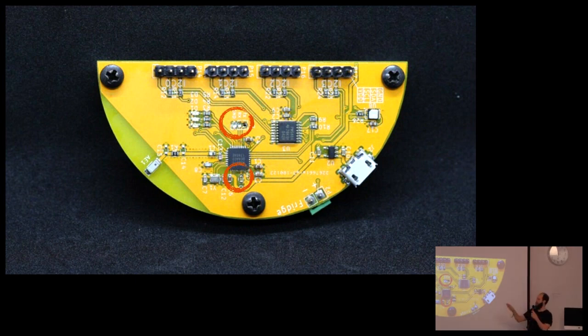And the default firmware I was using was enabling the DC-DC converter and trying to basically get power from components that weren't there. And the only reason it was working was by pure chance, because the debugger was providing enough power to kind of give it a kick to survive. And then every time it would restart without the debugger, it would just die. So I eventually just reprogrammed it with a setting saying, like, hey, there's no DC-DC. Don't try to turn it on. But that was a couple days of just debugging.